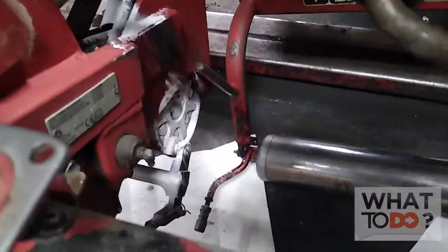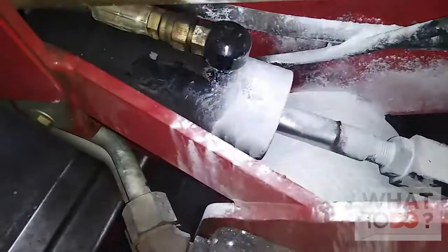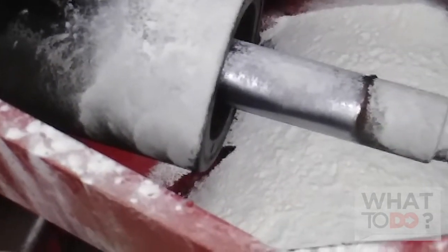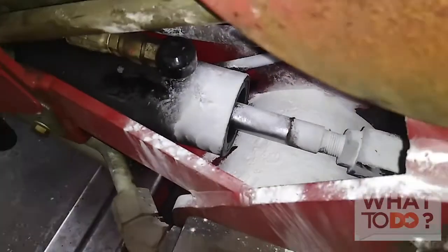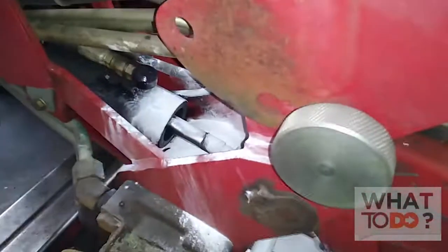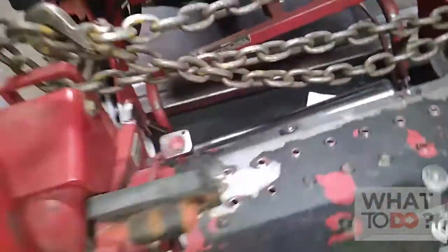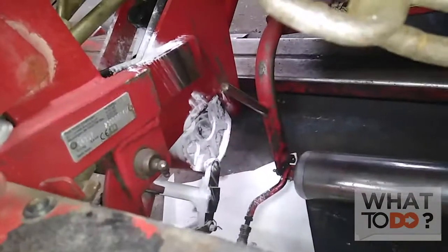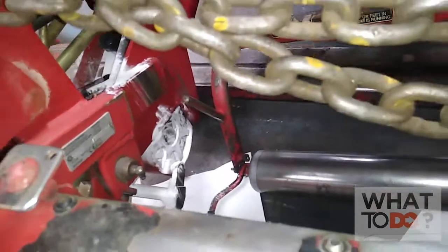Over here we still have no leaks, but over here if you look closely in the baby powder right back there — I'll turn the light on — you can see it's leaking in the baby powder. That would have been hard to see without the powder. It drips down the back and drops from the bottom, which gave the impression it was coming from the wheel motor. That would have been close to $700 to replace that wheel motor, but it's not coming from there.